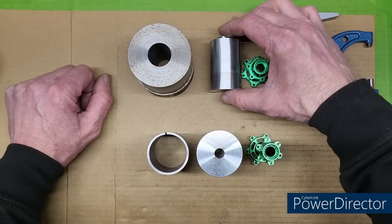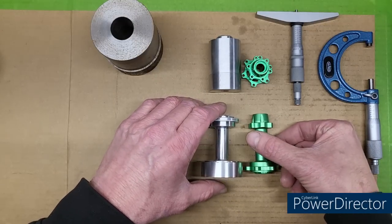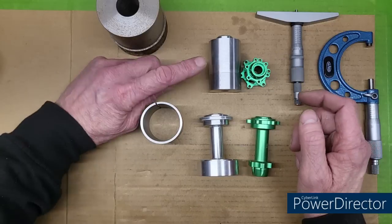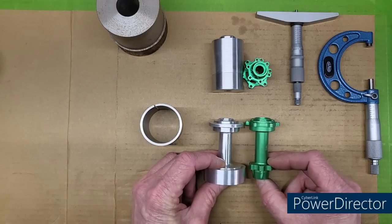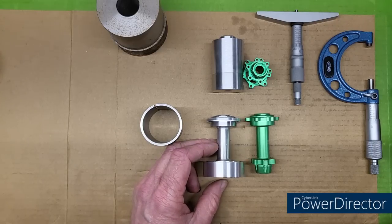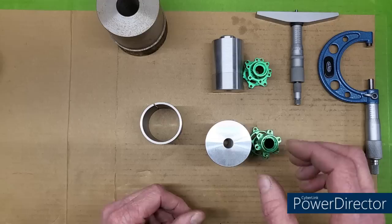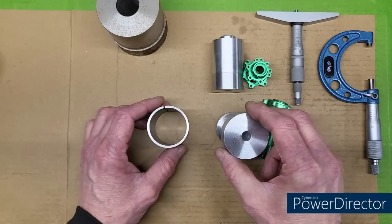This is his round stock right there. When we started this, I didn't have the correct diameter length round stock, so I had two pieces of square stock. We turned them round — there's a video on that. Austin has plenty for workholding, but the longer piece only had enough to just get that hub out of, as you can see. So we had a workholding issue that was going to come up. I stressed this in other videos — plan your jobs out. When I started planning this out, I knew it was going to come down to having to do the detail on this side of the workpiece, and we were going to have a workholding issue because there wasn't enough material.